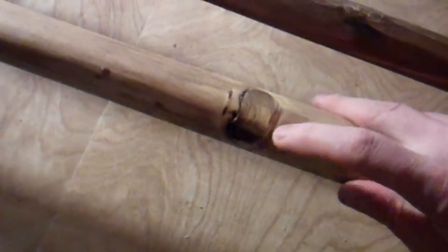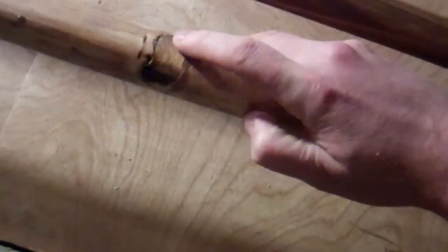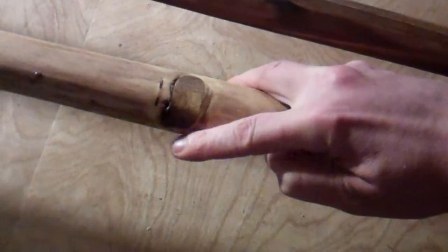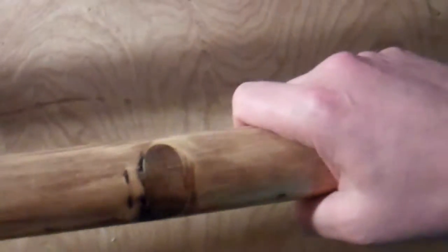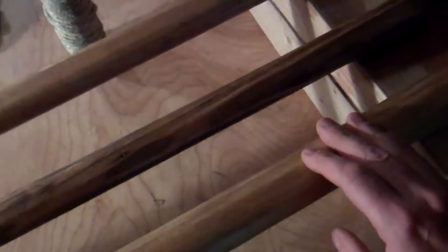There was a cool little spot — after I had cut it, there was a knot and it just popped out with a planer. So I took a dowel, laid it in, and it fit perfect in the hole. I tightened it overnight, then came back and sanded it down. It's a homemade knot — I never thought I'd fill a knot like that, but it works so well. We'll see when the water gets to it.